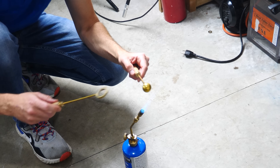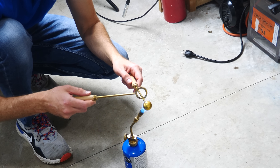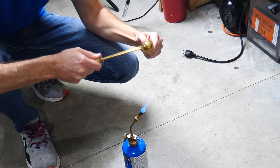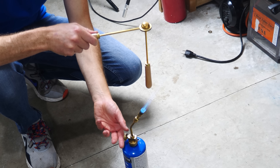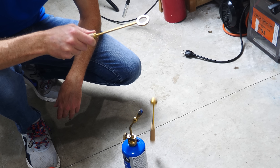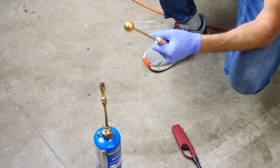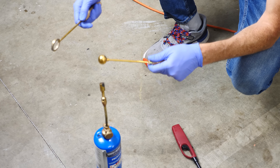I'm going to put it through like this, but now I'm going to heat the ball up. So now it's been heated up for a little bit, and now it doesn't fit anymore. I'll just hold it here, and once it cools down it'll be able to fit through again. So just by heating up the brass ball, it was able to expand a little tiny bit — but the only way we were able to see the expansion is because I had a ring that fit almost perfectly around it.